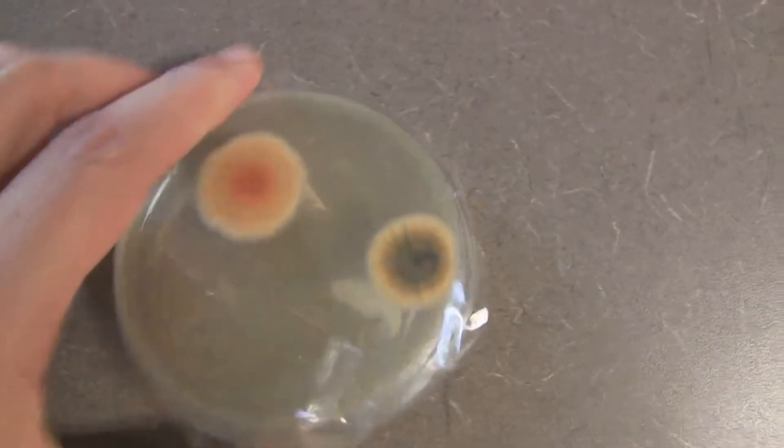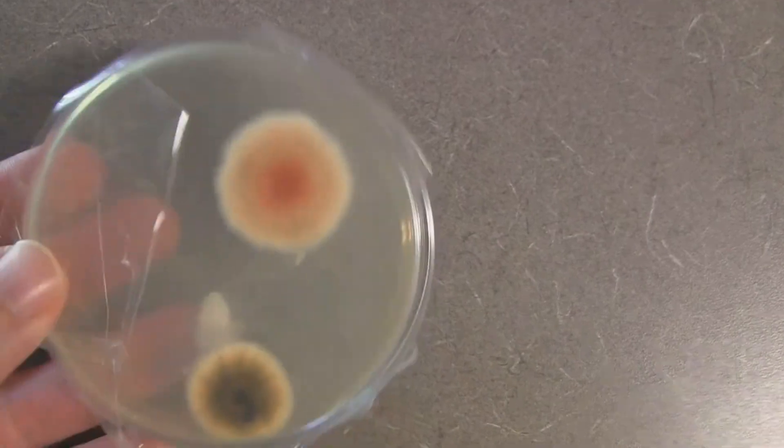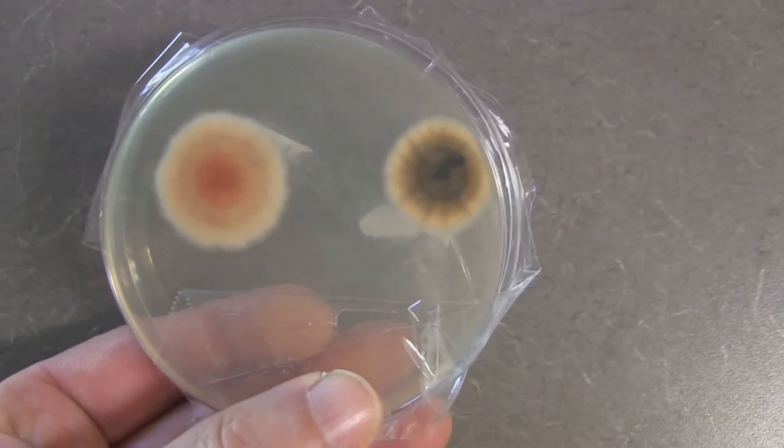The test I really want to focus on is the HVAC air sampling test — that's going to tell you if you have mold in your air handler or your ductwork. Once the solution is ready in the petri dish, you tape the petri dish to a vent, turn the AC on, let the air flow over it for 10 minutes, take it down, put the lid on it, keep it covered, and look at it in two or three days. If there were mold growing in it, it would look something like this — that's the top view, and here's the back view. You can probably see two different types of mold right there.